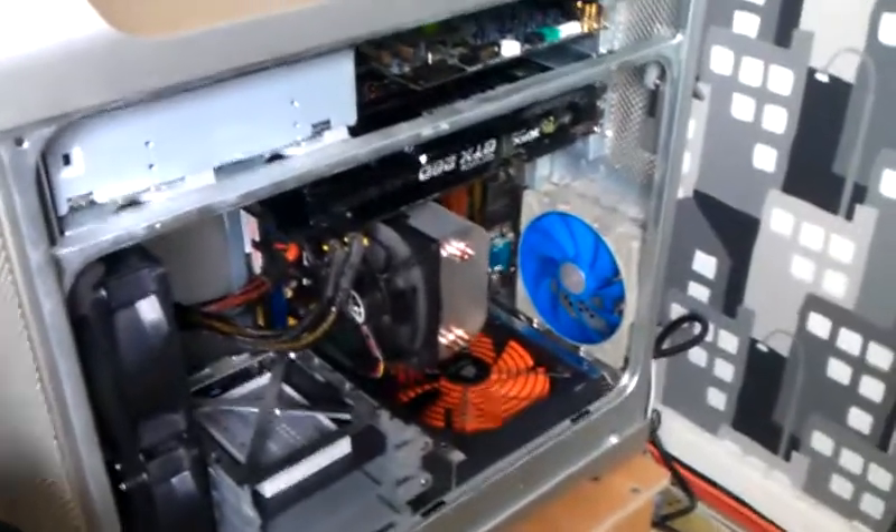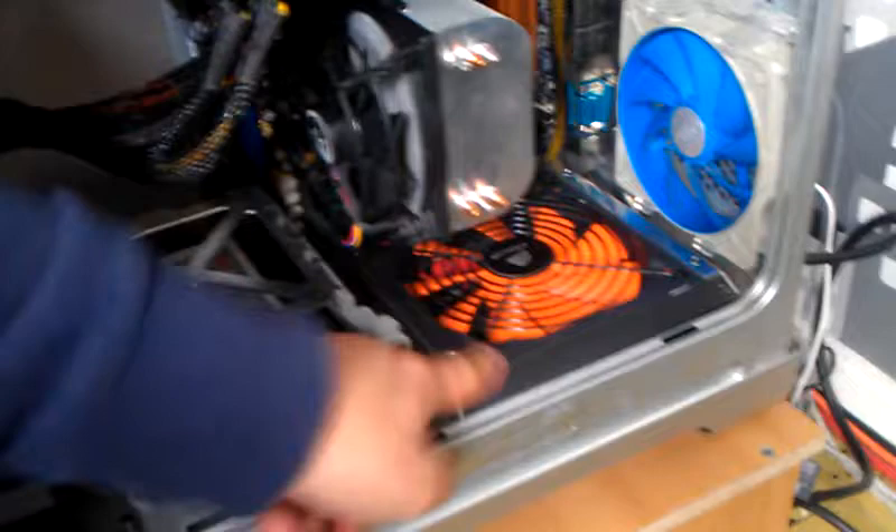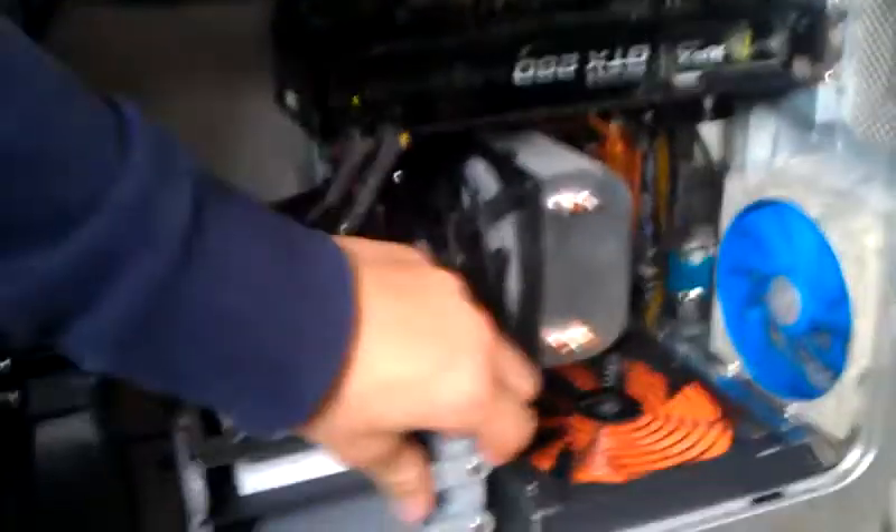It's not a race machine — it's a dual-core AMD Athlon, I think it's 3.2 GHz, a 65 nanometer CPU, so it's quite nice. I've got an old GTX 260 graphics card, my old Corsair GS600 PSU, and a little 64GB SSD that I had laying around. I did use the original stock Mac drive cage, just mounted on the floor here. It's an elevated floor made out of aluminum, and that hides the cables in the bottom. It's handy and looks nice — just bent up here, mounted to the power supply.